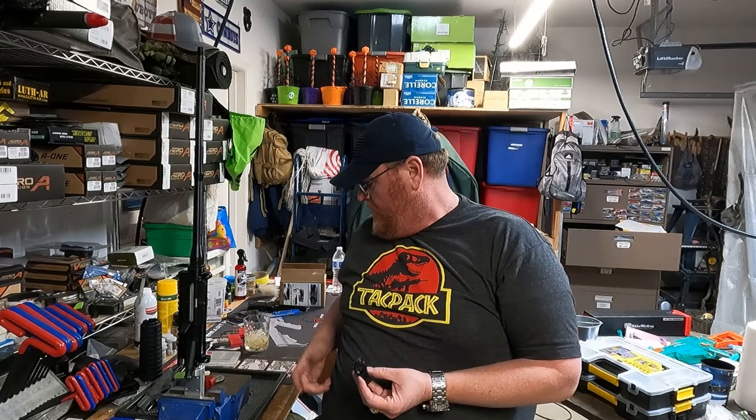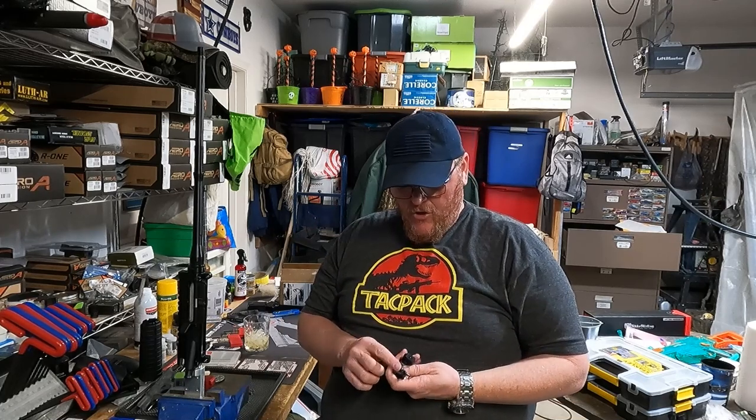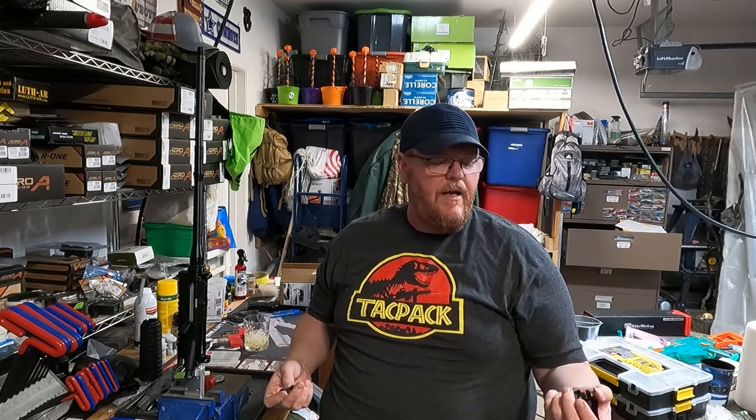Having the background that I have — I used to build airplanes for Cessna, my family built airplanes for Boeing, and my dad built and remodeled several of the Air Force One 747s and the 777 when it first came out in the late 90s — I recognized that it's not just a screw, it's a rivet. So I drilled out the rivet, knocked it out, and pulled the sling ring off. You can always put it back on with a bolt and nut, or a new rivet if you want to reuse it.